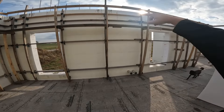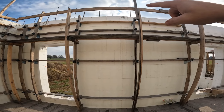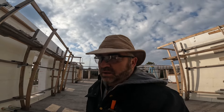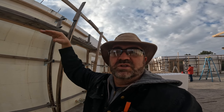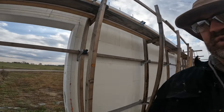We are nine foot four to the top of the second-to-top block, which is pretty much what the basement was when we poured it. That's where the first pour went, giving us enough room above all of our windows to get our lintels poured in. The second pour will be a smaller pour, and all of the blocks will be cut on an angle to get us the roof line.